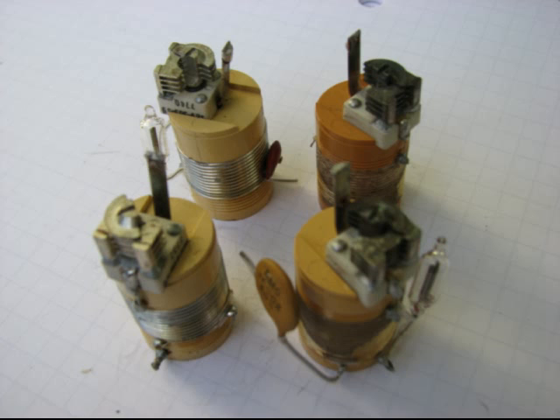The helical resonator coil sections in the front-end bandpass filters turned out to be these plastic-like coil forms that had just the right amount of wire wound onto them, with nice little air variable tuning caps to tune the resonators. I'll either keep the caps or try to put these back in some enclosure to tune them up. They ought to cooperate for maybe a 2-meter sideband rig as a front-end filter, and may have a better Q than what I could get with just air core coils.